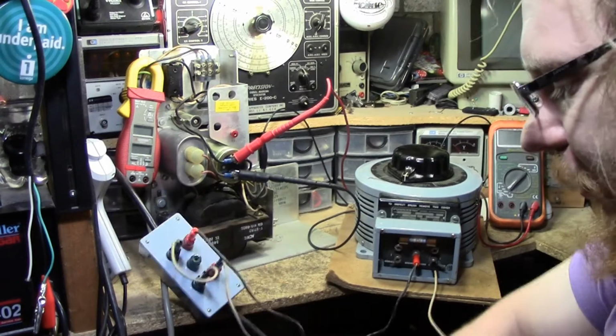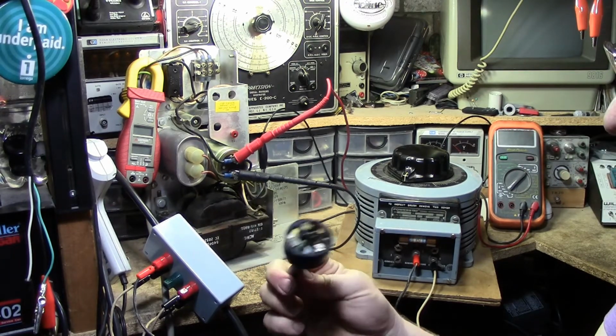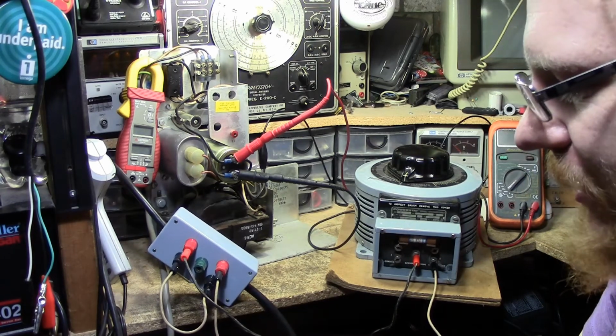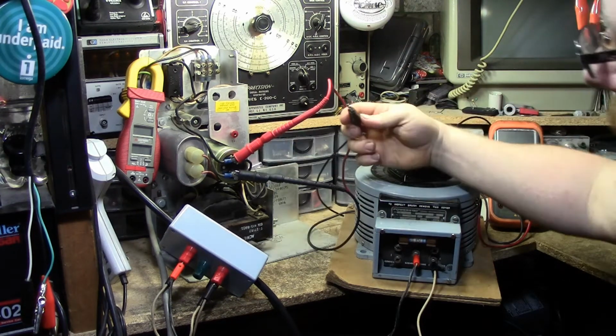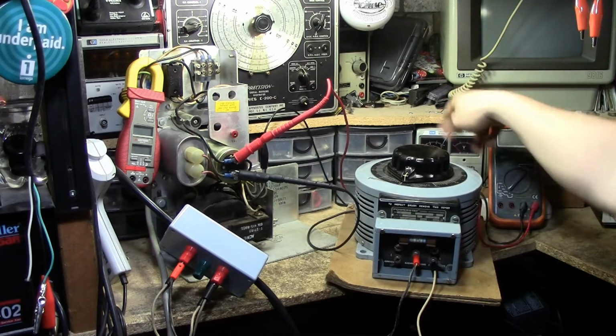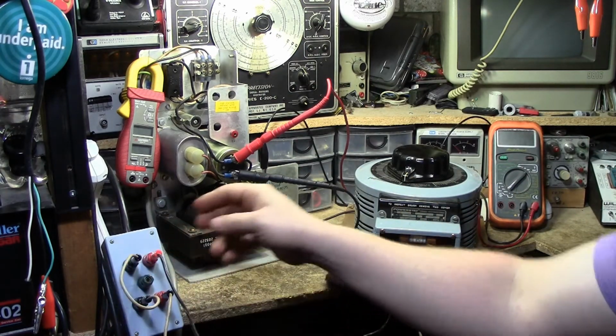However, I can't help but notice on this power supply, some schmuck has cut off the ground pin. So, okay, that ground's not going to be all that useful. Instead, in this laboratory application, I have this extra alligator clip cable here, and that goes to another earth ground tap that's on my bench here. So it is still grounded for the duration of this test.